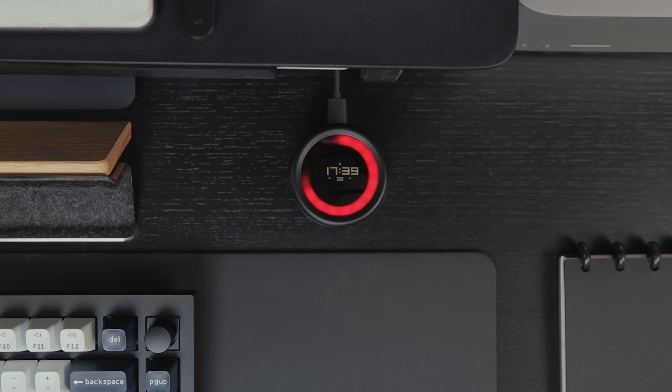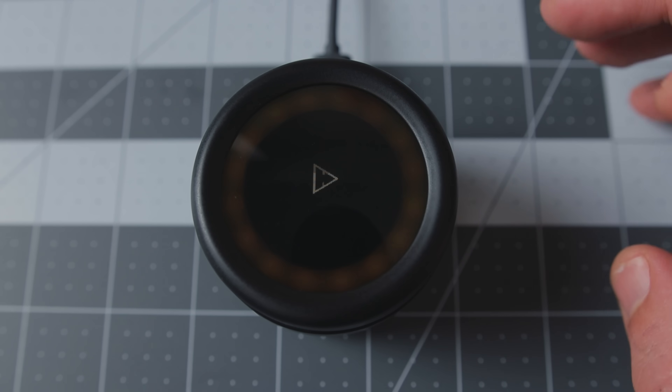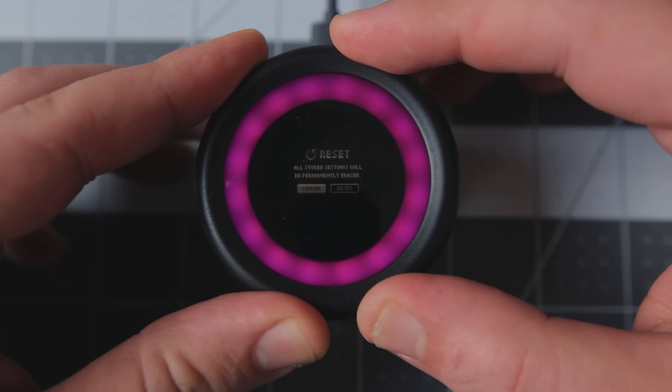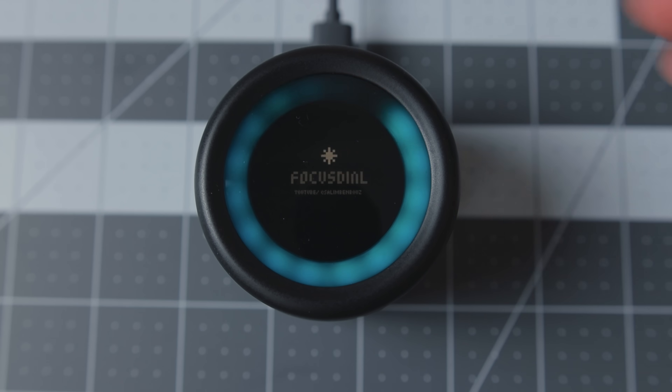When the timer starts, the network controller initiates both the webhook and Bluetooth tasks at the same time and starts the countdown using a decaying animation to represent the remainder of the duration. You can pause the timer by pressing once, or cancel it altogether by pressing twice. Holding down the main button for a few seconds brings up the reset state that allows you to erase everything and trigger provisioning again. I've tried to keep the project organized and modular for easy customization, but I'm sure there are many ways to improve it. You can check out the code in the link below, along with the files and build instructions.